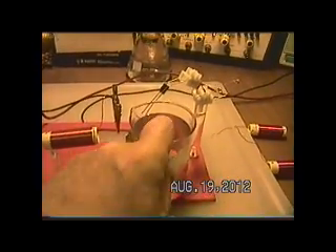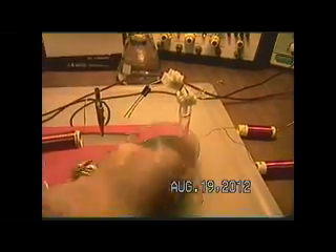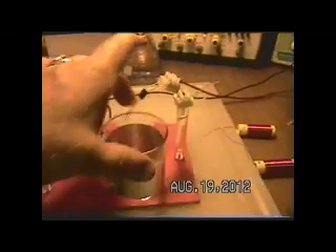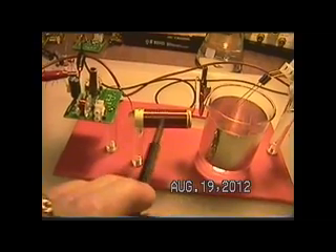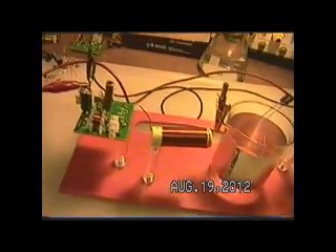What I'm going to use for my cell is a 150 milliliter lab beaker, filled up to 150 milliliters. The outside is wrapped with the aluminum tape that I always use. We have an L3 here — a modified L3, so be aware of that. The reason it's modified is I've taken a couple of turns off to get the frequency up closer to what we need.